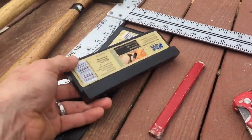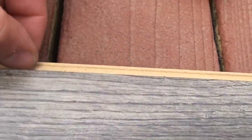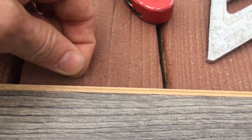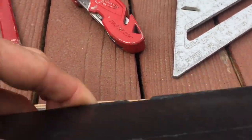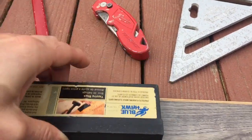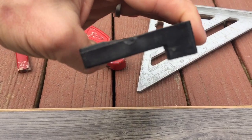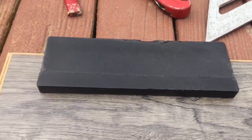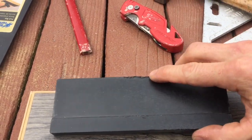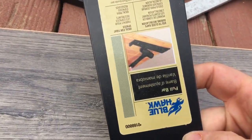These two tapping tools are crucial — they keep you from damaging the grooves. You can see there's a small lip on the male edge of the board; if you break this off, the boards will not sit properly. This tool sits on the board — there's a little groove that covers the depth of the lip — or you can switch it for larger coverage. You place it on the edge and tap your board in with your hammer. Using a metal hammer did beat up the tool a bit, but it got the job done.